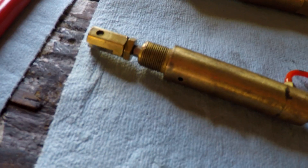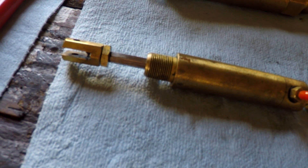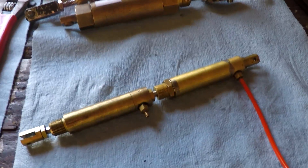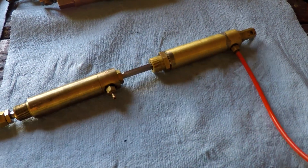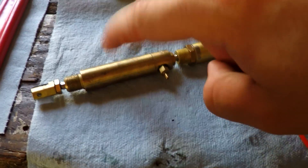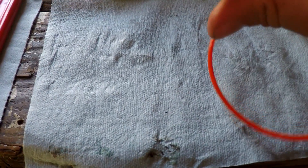In the future I'll just have to replace them. These are definitely leaking, blowing by the seal. To show a comparison, the second eye turn cylinder is fine — that's how it's supposed to behave — and as you saw, the first one is leaking. I don't think these eye turn cylinders are rebuildable.